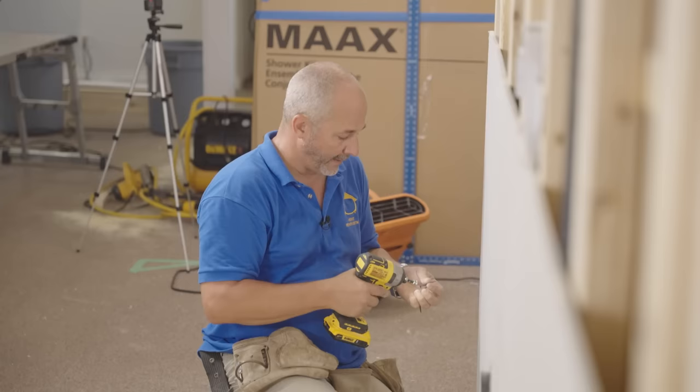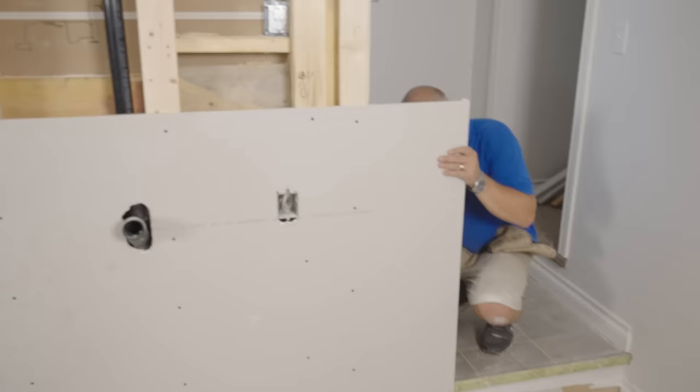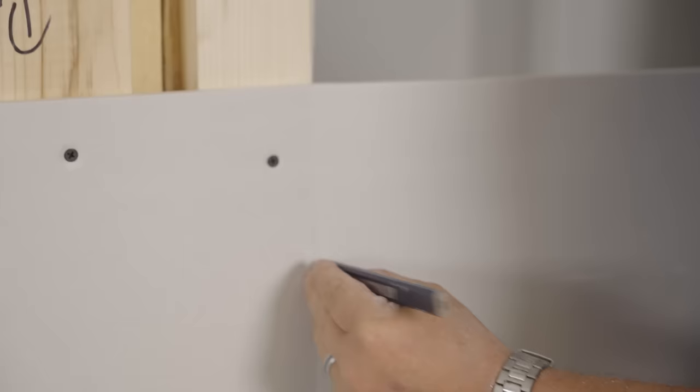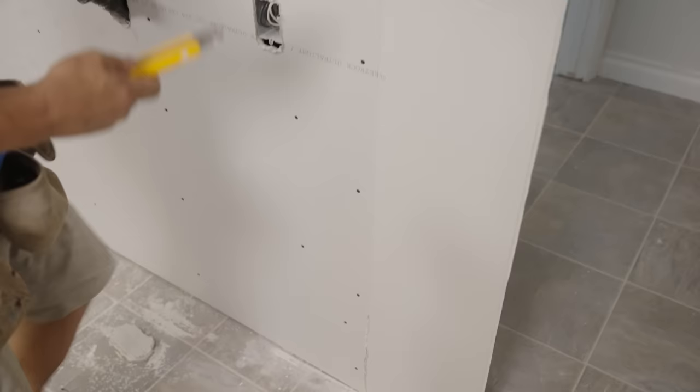Now when I'm done putting this sheet in, I'm gonna foam all those holes. Now, I can't reach to the bottom. The stairs cause me some issues. So I score the backside and I'm gonna just create this wet ridge here. Now you can probably see this on camera, okay? This thing right here, that ridge. So instead what I'm gonna do is rotate it from the bottom up, cut that clean. Here we go. And now I can score it.